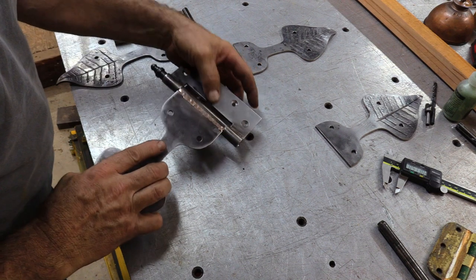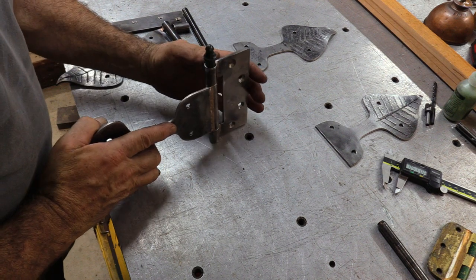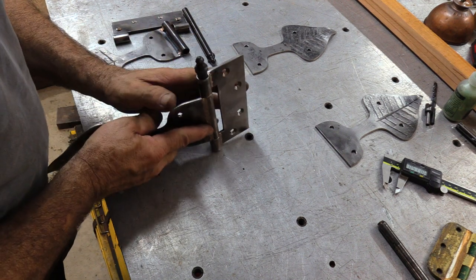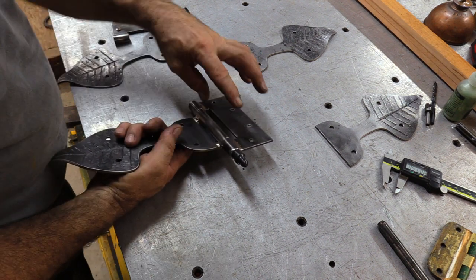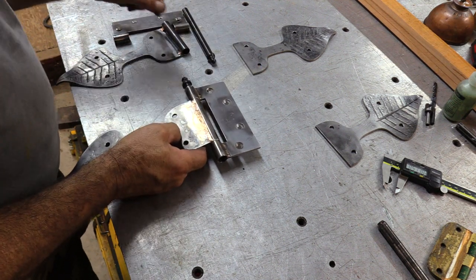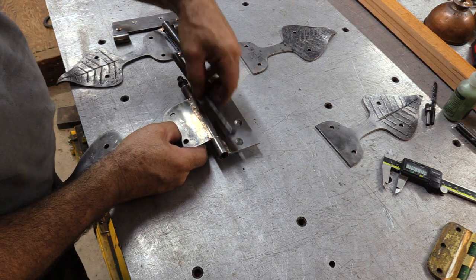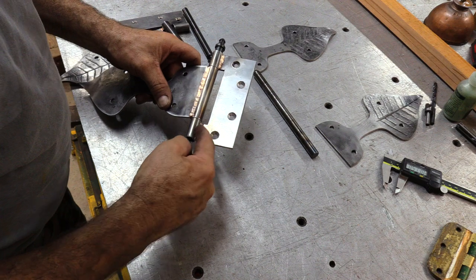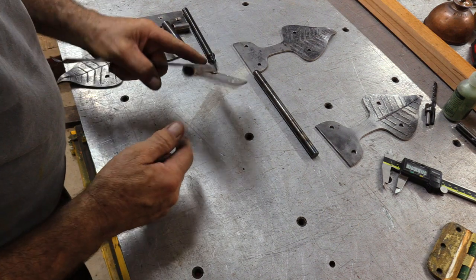So, setting these onto your tubes of the pivot, you want this surface to be at the centerline of your pivot. I needed 3/16 offset to do that. So I put my 3/16 fireball tool blocks underneath there, and set this all up pinned together with a 1/2-inch sacrificial pin I put in there to hold all the tubes in alignment together. And I TIG brazed these portions to this plate, both sides.